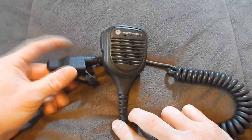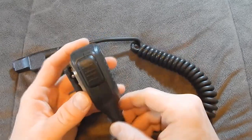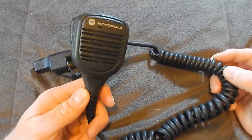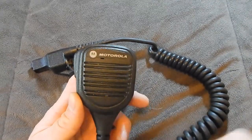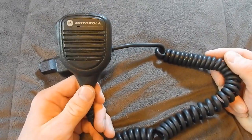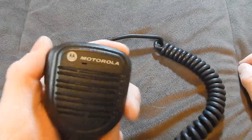This is one of the ones I eventually bought — a Motorola shoulder microphone that is a noise-canceling microphone, which seemed like a good idea at the time. It actually ended up not being a great idea because where I work isn't normally a really loud environment. I used this in a train yard and it worked fantastic, but in normal use — there's a little hole and a microphone on the back — the radio cancels out from what it transmits anything the back mic also picks up. So you have to talk really loud into the front, or physically remove it from your lapel and speak directly into it. You can't just look down, key up, and talk at the microphone.